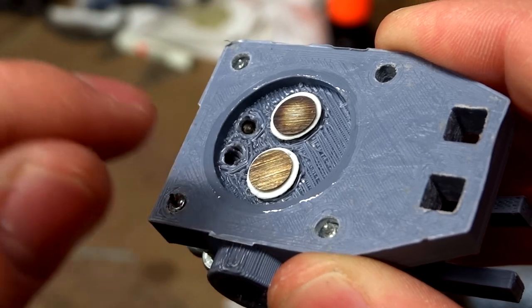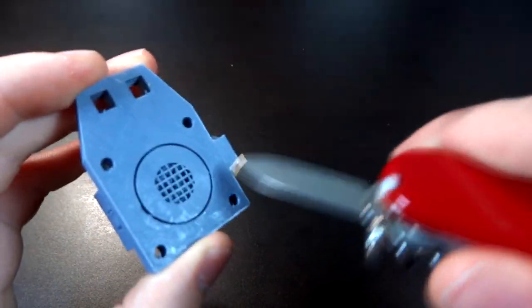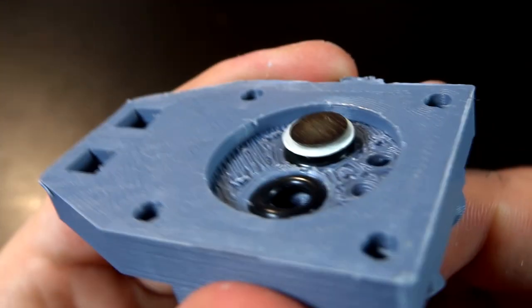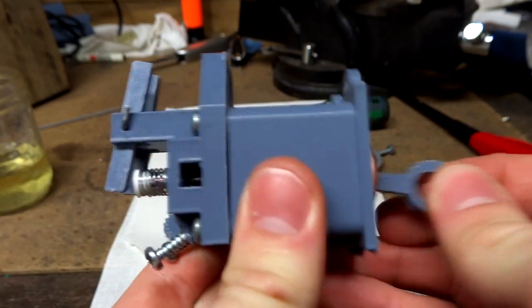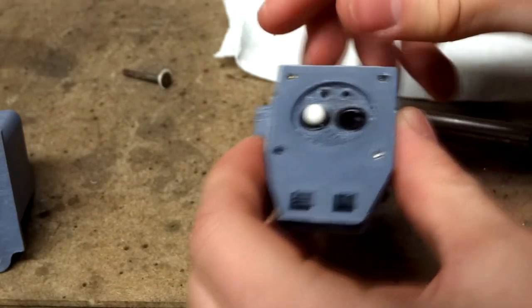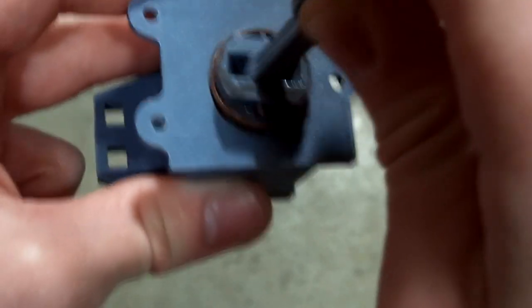It's not the fault of the piston — it's actually the fault of the head. I think what's happening is the air is making its way underneath the valves. So what I'm going to do is use the o-rings to create new valve seats and see if that will solve our problem. I bought this cool little knife a while ago, but I think it's no match for this task — only my iconic Swiss Army knife can handle it. This new head has cutaways underneath where the valve will seat for the o-rings to go. After gluing the rubber o-rings into place, let's give it a try. You can see it's still leaking air and it sounds like it is still coming from the head.